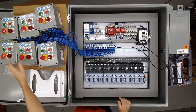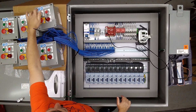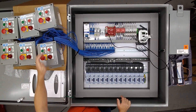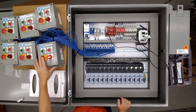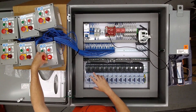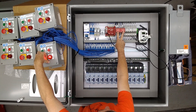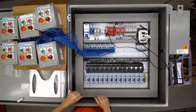Just a quick rundown of basic operation: start, stop — cycling through all six stations. Then press one of the e-stops. The local light comes on. The thumping you hear when they pull the e-stop back out is going to be these two safety contactors. And it does automatically reset.